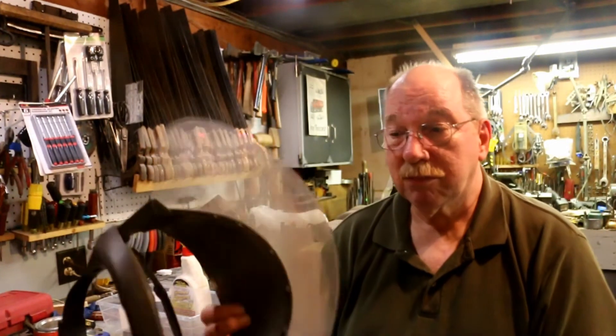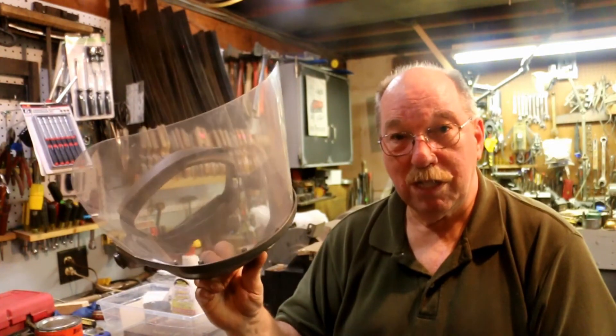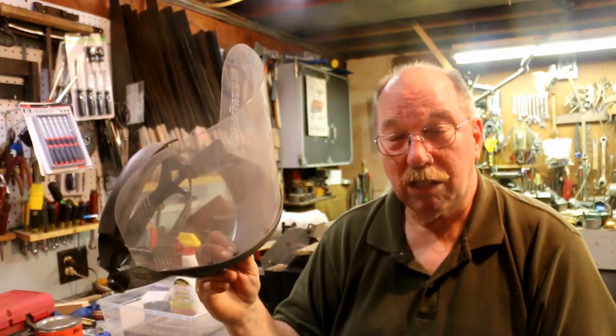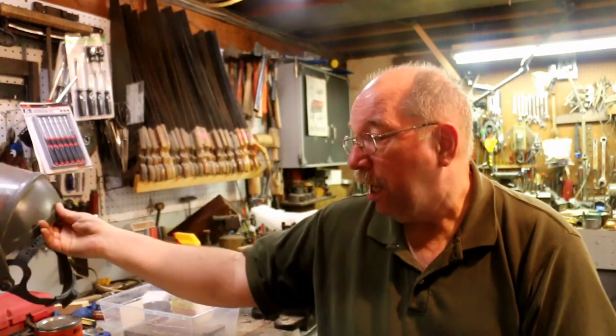You mentioned that your son is the one you're teaching how to use a wire wheel. I regard my eyes as very important — I have to be able to see to do most things in life. So I protect them whenever possible. When I'm wire wheeling, I wear a face shield. I'm not perfect, I don't always do everything I should. But I'm telling you because I want to protect your eyesight and I don't want to be responsible for you becoming blind or suffering an injury. A wire entering your eye at a high rate of speed is a bad, bad thing. Wear a face shield. I taught my son to wear a face shield simply because no matter what wire wheel you get, it's going to shed wire.